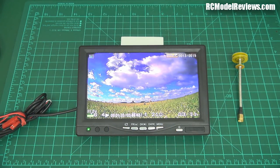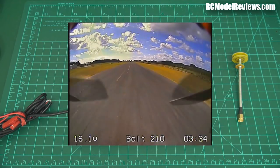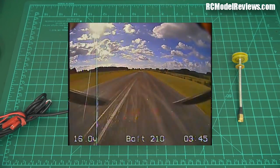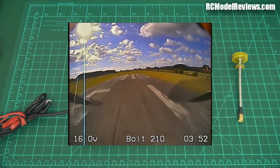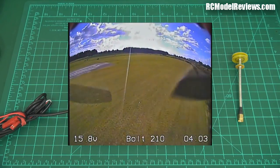I went and flew both antennas around roughly the same course. This is the test flight with the Pagoda antenna on both ends. The idea was to take off, fly to one end of the airfield, fly back to the other end, and look for things like dropouts, multipathing, and generally the range provided. We're now heading down towards the north end of the airfield — notice there are a few occasional flickers but it's pretty damn good. The total distance down here is about 500 meters. I tried to stay fairly low because that puts us right in the Fresnel zone.